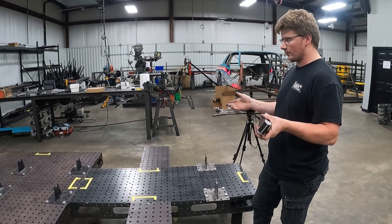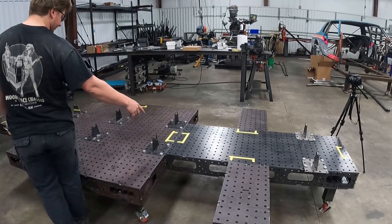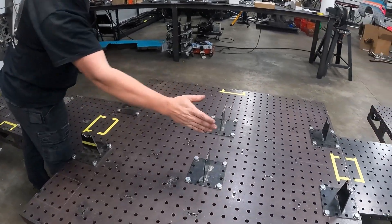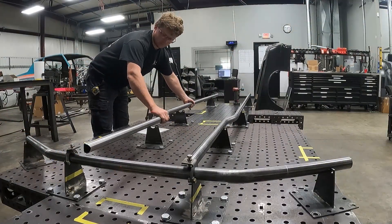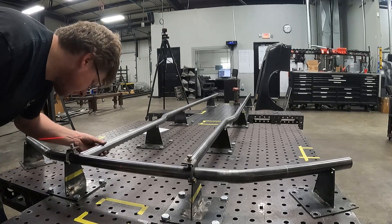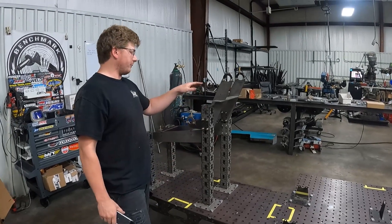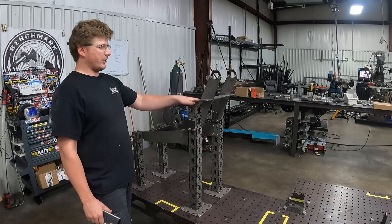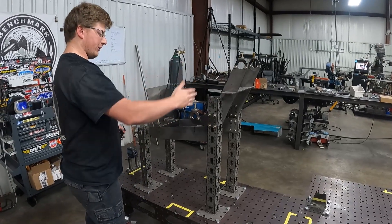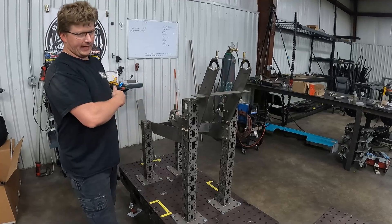It's all level and set up. It might not look like there are a lot of clamps, but these are for the inner frame rails. Number one bar is going to be right here, and the frame rails come in with a bend to give clearance for the transmission and everything. That's why these are further in and those are further out. It's a full strut front end, so the lower frame rails go all the way forward. The back half jig is there — we keep all of our back cast pretty consistent, so these all end up in the same location. We can move the whole thing front to back; sometimes the height changes, but we try to keep all the back gap stuff the same.